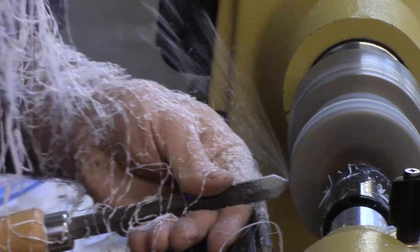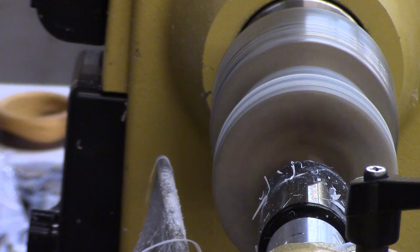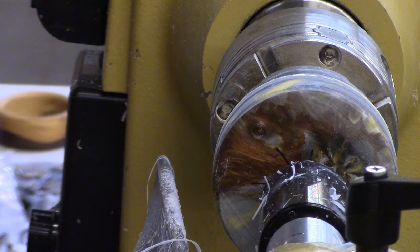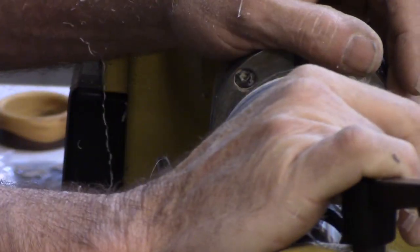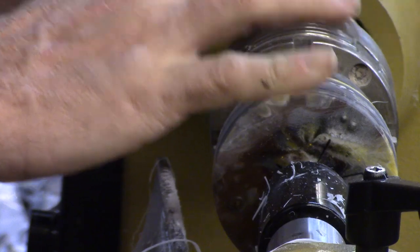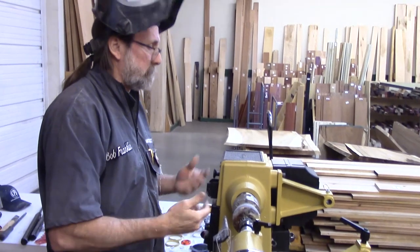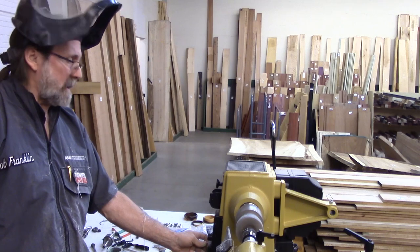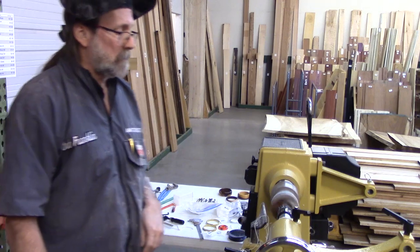So if this was a pin, if you're using one of our blanks and turning a pin, turn your lathe speed as high as you can turn it safely. So I turn it full speed, 3,400 RPM or something is what I'm at with my lathe. The smaller the diameter, the faster you need to turn. So if I'm doing a big 4x blank, this is a 3-inch. If I'm doing a 4-inch blank, then I'm turning less than 1,000 RPM. This here, we're at 1,500. And now that it's round, I could easily increase that a little bit and get a better cut even still.